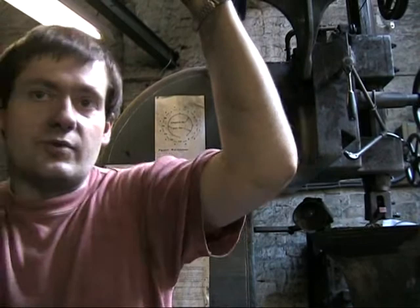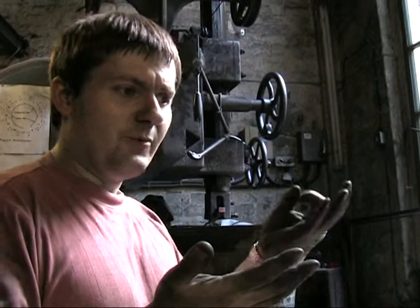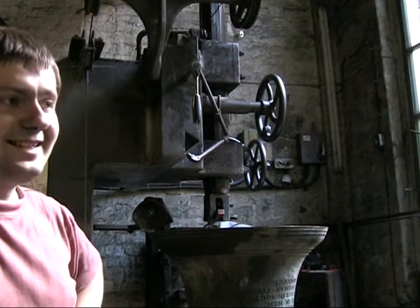But of course it's the higher frequency ones that give you the strike note. So a bell where the hum is a long way out from the strike note, you'll hear the strike and then it will start humming at a frequency that's not related, so it just doesn't sound right. There's no point making them too good, otherwise they won't sound like they belong in the same ring of bells. And you get this ding, ding, ding, clunk, clunk, clunk.